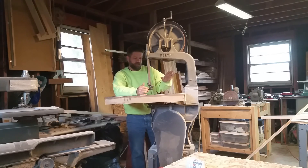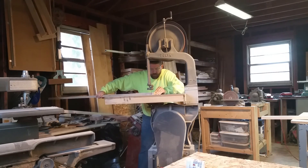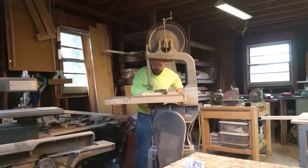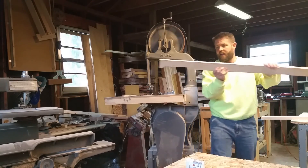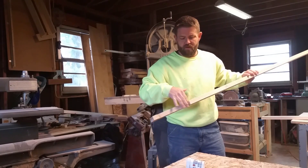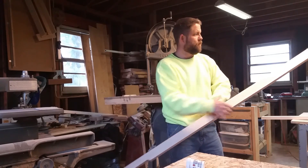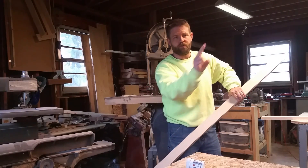I'm going to go ahead and get these two wheelbarrow handles cut on the bandsaw. That's somewhat how they're going to look. I'll take them over to the oscillating sander to clean them up. If you don't have one, just use an orbital sander or a block sander with your hand. The next video will cover putting in the holes for the wheel, the two hand knobs, and the two holes for the rocker box to accept the hand knobs.